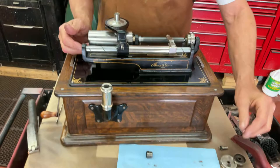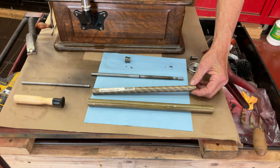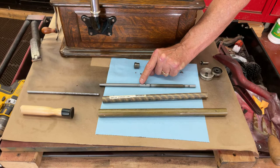The bearing. You have to build your bearings in this bunting bearing material that has lead in it, and this is for running surfaces. They use this kind of material in machine tools. You cannot use brass. Brass is too gummy and too sticky, and it doesn't oil in on the bearing, because the bearing runs on this little piece right about there.